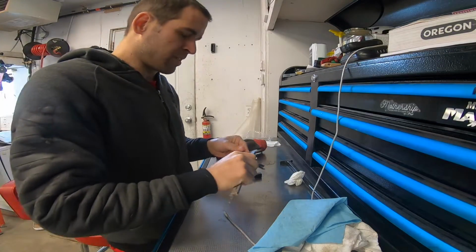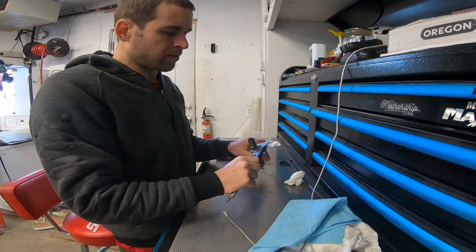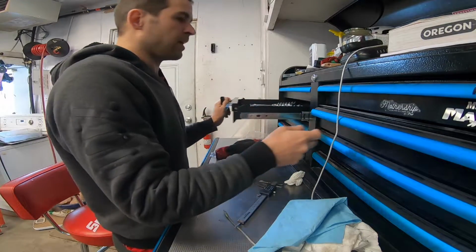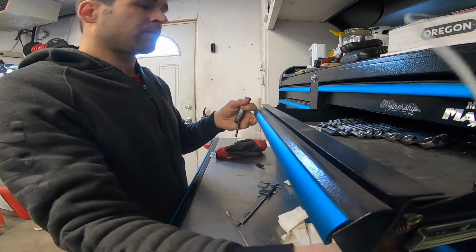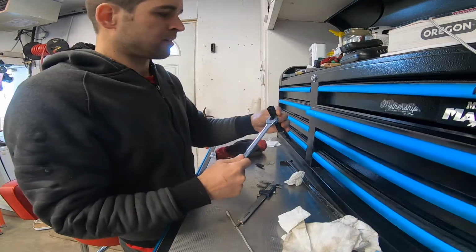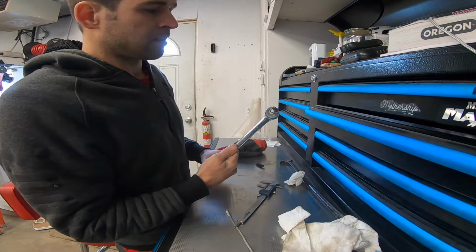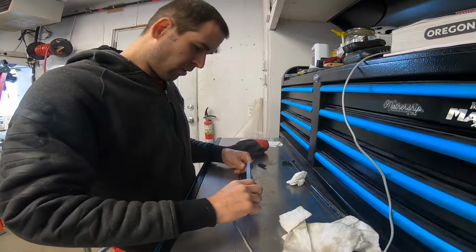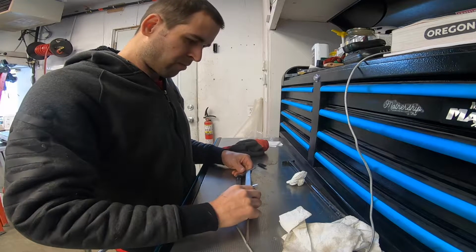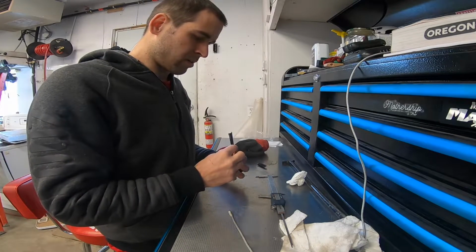All right, measurements. So 16 millimeter, 632 thou, which is what, 5/8? Here's an easy way to find out what size something is, if it's a nominal size anyway. Take a wrench. Put it over it. 5/8. Overall length is about 5.2 inches. So now we gotta find a piece of material that we can use.